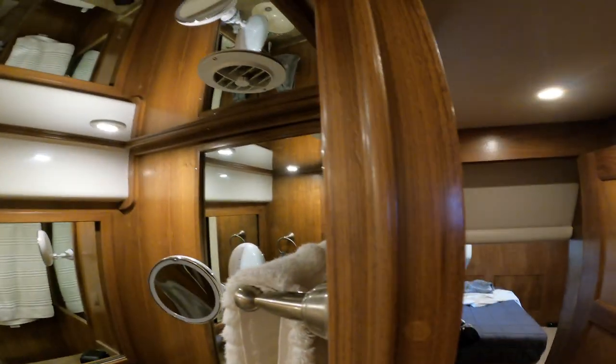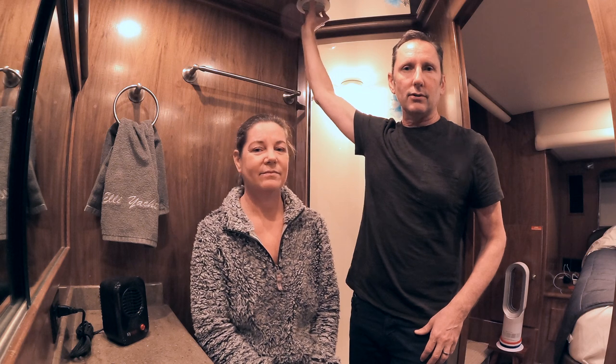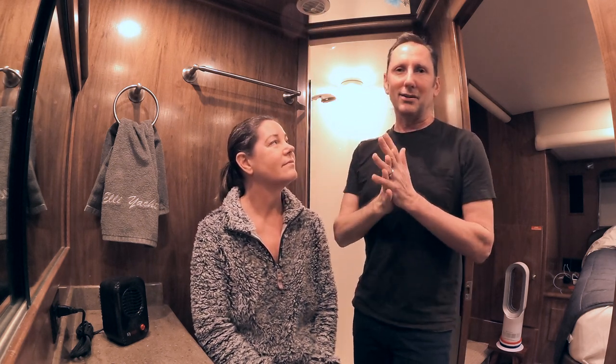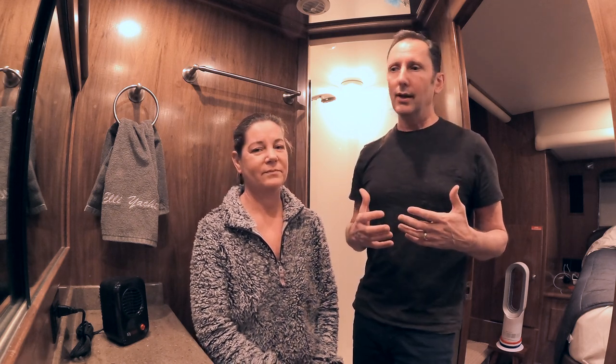So that brings us to ventilation. This boat came with really small and very loud vents up on the ceiling. They're placed pretty well and have cool louvers you can adjust to pick up moisture. The problem is they have only three-inch ducting, which is far too small. These squirrel cage fans — loud as hell — are about 105 CFM, or cubic feet per minute. It's probably not too undersized for this small area, but it just doesn't draw the moisture out fast enough.